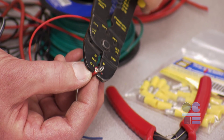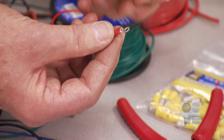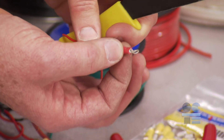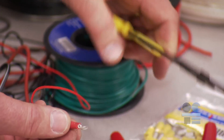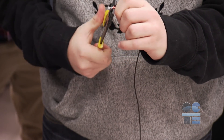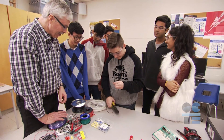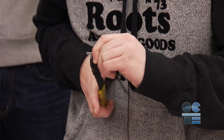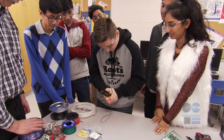All you need to do is remove the crimp pin, rotate it 90 degrees and repeat the crimping process. Inspect the crimp. Take the pin out from the tool and make sure that the pin's legs are crimped into a circular fashion. The legs must be circular for the pin to be inserted into any type of connector. If the end of the crimp pin is not circular, repeat the crimping process by putting the pin back into the tool, crimping and rotating 90 degrees until you have a circular crimp.